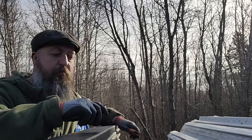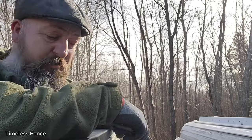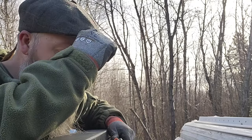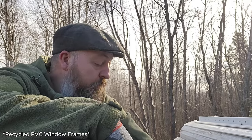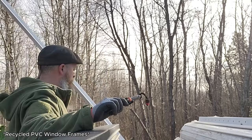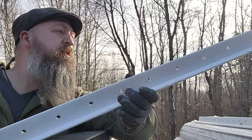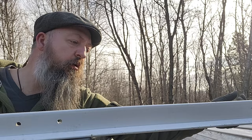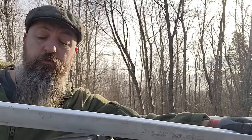So what I did here is I bought 30,000 feet. It's called a timeless fence. If you've never heard of it, check out Greg Judy on YouTube. He is a great advocate for this fencing. What it is, it's made out of PVC pipe, and I've got poles 6.5 foot long. You bury them about 18 inches, and then after that point, they're in there pretty darn good.